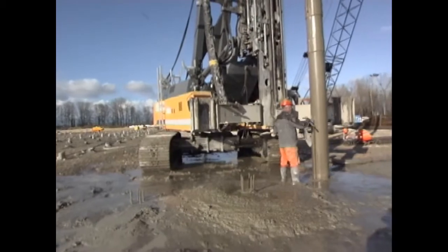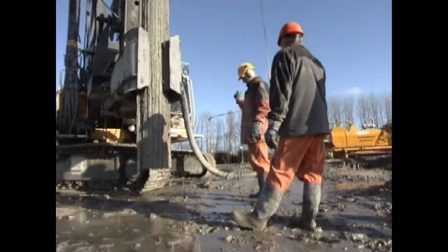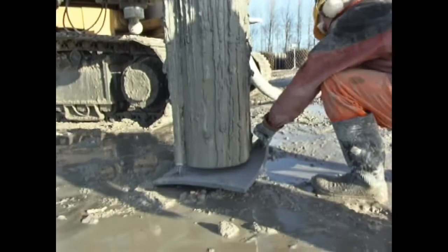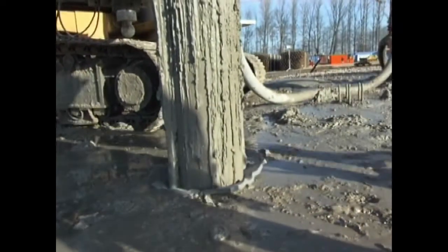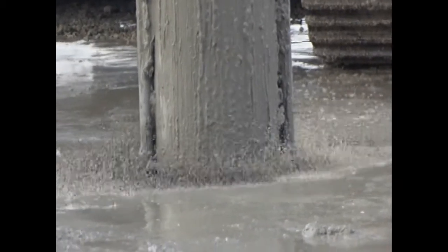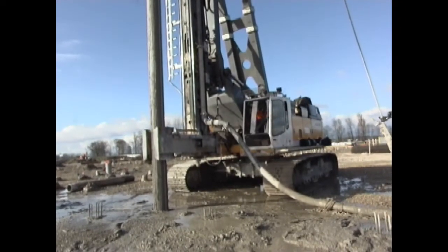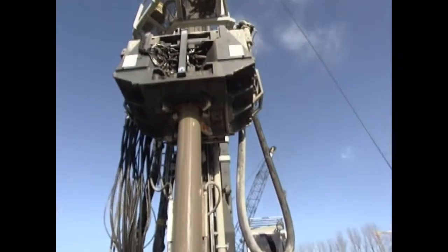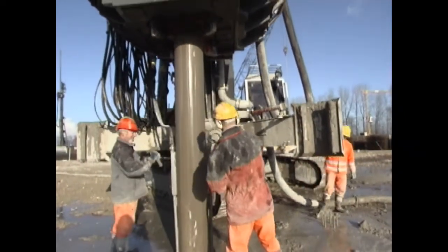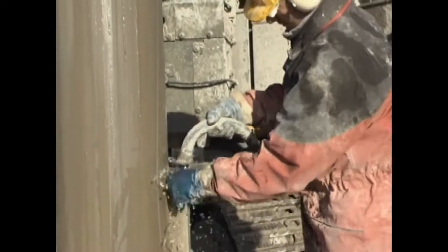with ball valves. To create these piles, a single-wall steel pipe which is closed with a base plate is vibrated into the ground. The base plate is fitted with a seal to prevent intrusion of groundwater. The sealing plate, which seals under pressure, is not relieved during the vibration process, so that destruction or reduced water tightness cannot occur. With the prevailing geological conditions on the building site, water jetting is turned off after penetration of the sand layers, and the areas beneath are vibrated without water jetting.